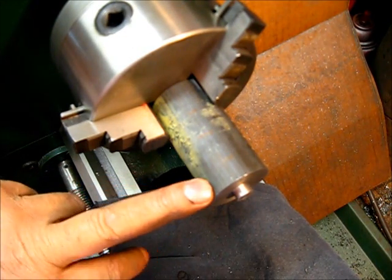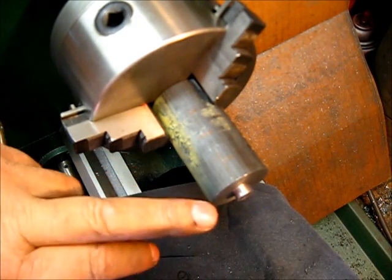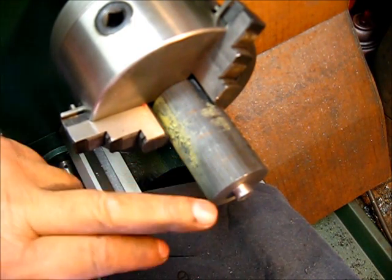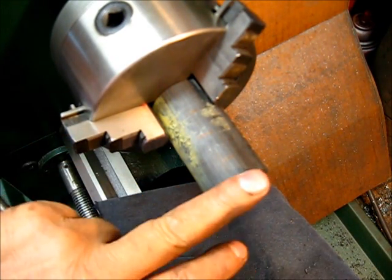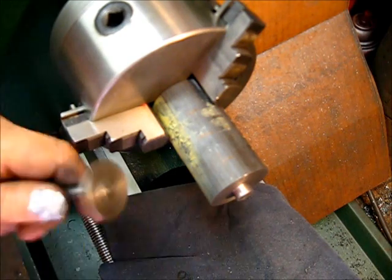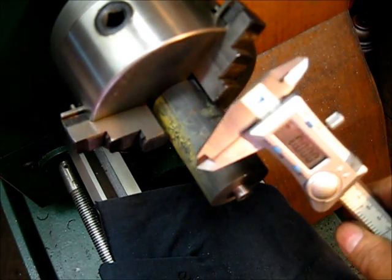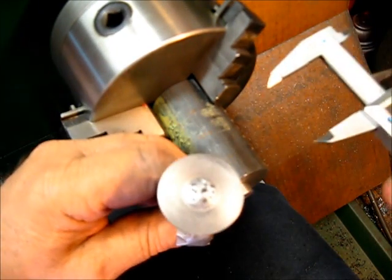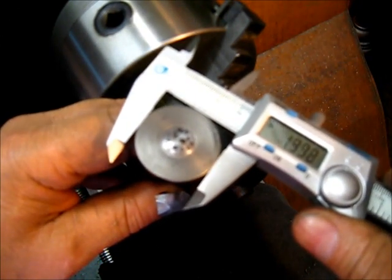This cast iron, as shipped, it's oversized to the size that I ordered. The outside, most of the time, will be hard. So you have to cut off the outside here to get down to the actual working metal. The easier way to know how much to take off is with a set of calipers — just zero it out to where you ain't got nothing on there, and then take the part that you're going to make, if you have that luxury, and put it right in there and grip up on it.